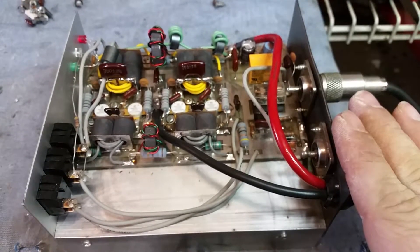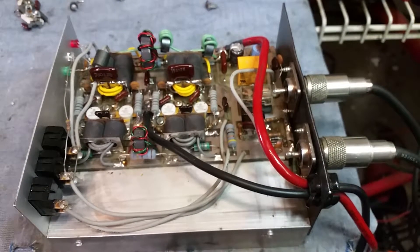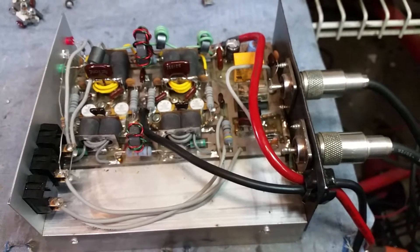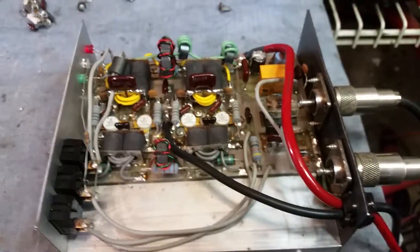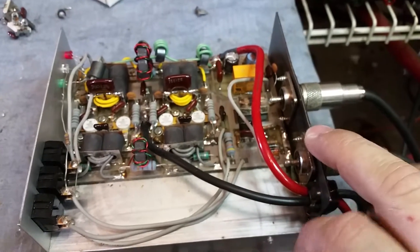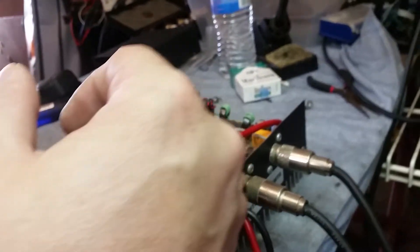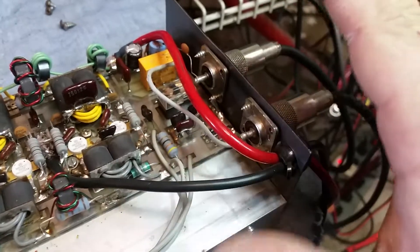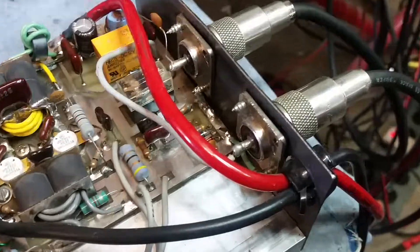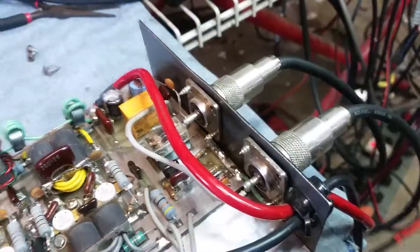The problem is they just build these things over and over again and put a set capacitor on the output — sometimes it needs a little more, a little less. This one needed a little more. One thing I do not like is they have no grounding on the SO-239s to the board. The back is coated, and if those things start getting loose, your SO-239s won't have a ground. So what I always do right off the rip is ground each of the SO-239s — put some solder on the screw and connect it to the board. I went ahead and grounded the SO-239s for you.